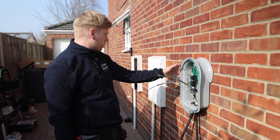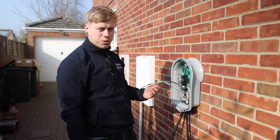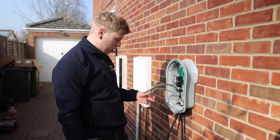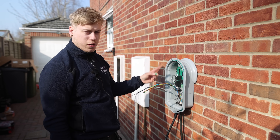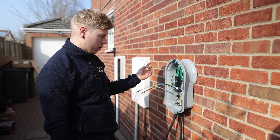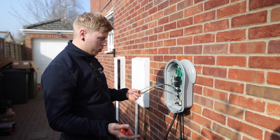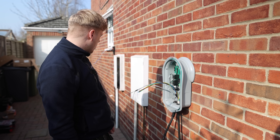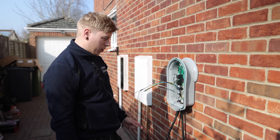While Luke's doing the board side, I've got the car charger mounted and glanded the EV Ultra in. I'm just going to dress this in — I'm not going to connect it up yet because we want to do our R1, R2 and insulation resistance tests before it's terminated. I've put a bit of heat shrink on the data cable and we're going to use two pairs. One pair is going to go into CT1 for the grid limit, another pair into CT2, which connects through to a CT that goes into the solar. That'll all be read on the screen on the Zappi, and when they look on their phone they can see how much solar they've got coming in and what the car is using.